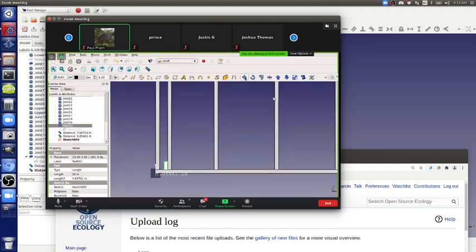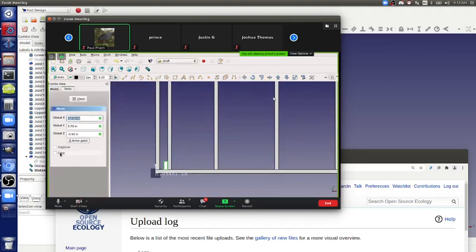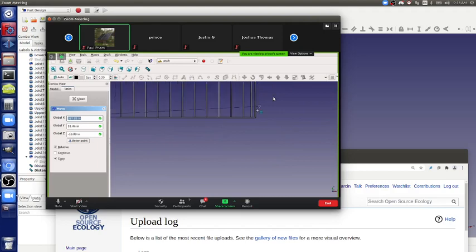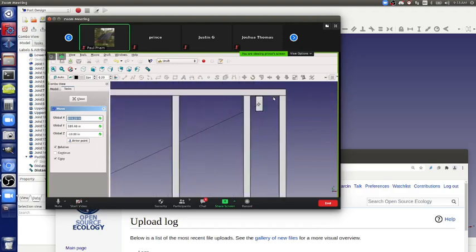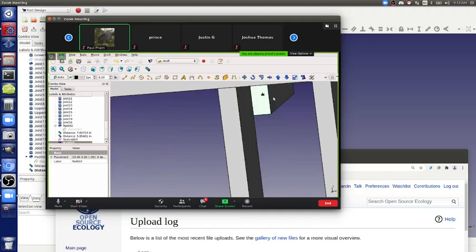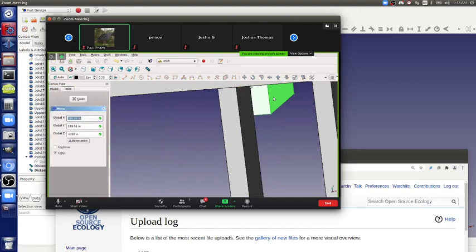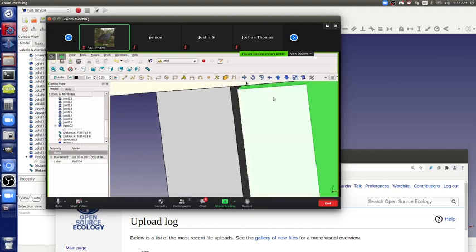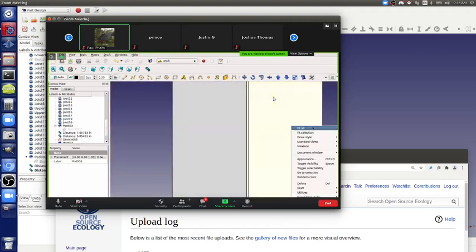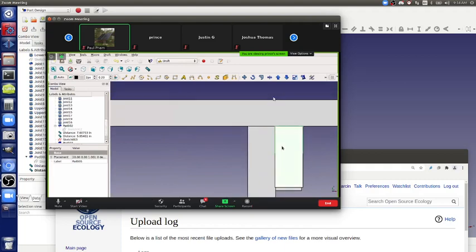Are you sure it's 6.5 from outside to outside? Because it's 5.5. Yeah. So now we're going out with it 3/4 of an inch so that you have enough space to screw in your ceiling. I thought I had the joist position correctly, 6.25 from zero. Well, but 6.25, I'm missing it, because to the outer edge, the plate is 5.5, and we want it half hanging off the plate. So normally you'd offset it 4 inches, right? Normally it's offset 4. Now it's going to be 4.75, or 6.25 if you measure to the outside. Yep.